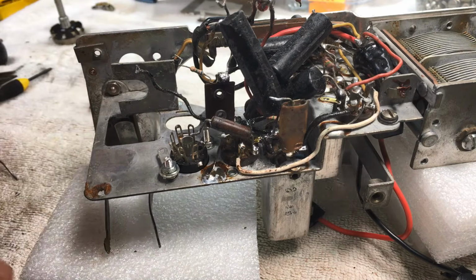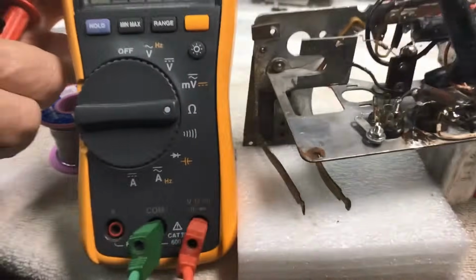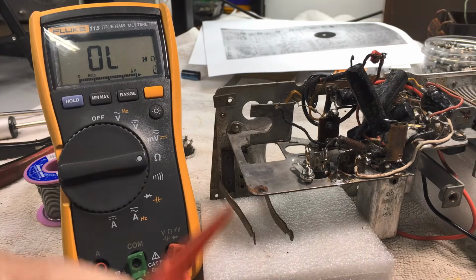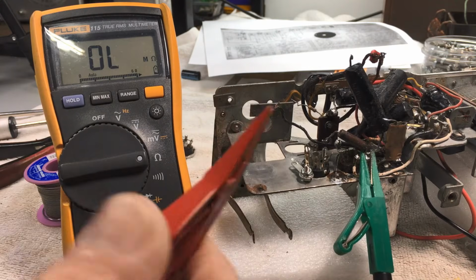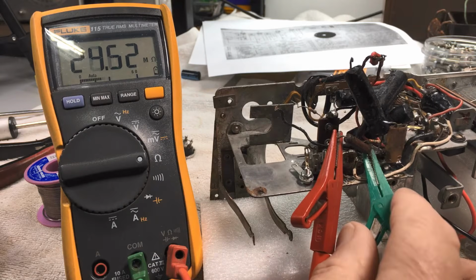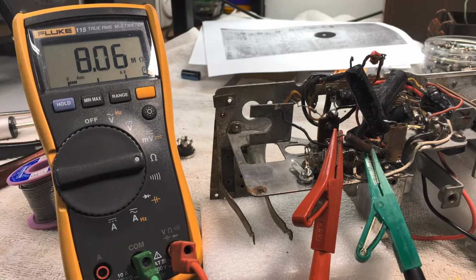Okay, so what I did here, can I squeeze, bring my camera sideways. Okay, there you go. Okay, let's measure him. Well, while we're here, we'll now measure the next thing, which is this resistor. And there it is. And you can see that it gradually increases. Starts off at about 6.5 meg, gradually increases, but doesn't sort of get to 10.